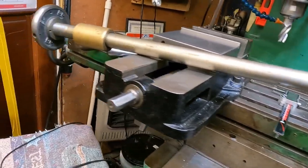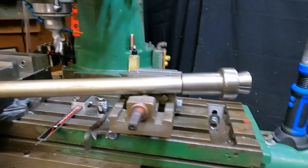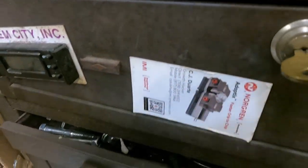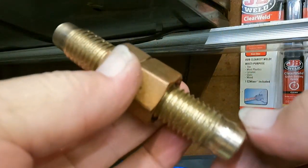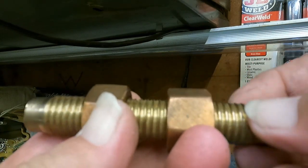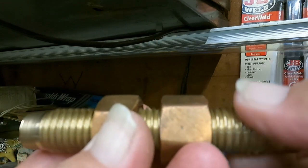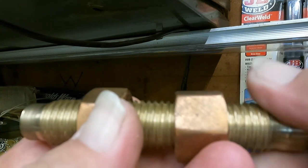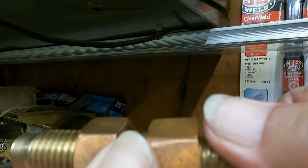And sometimes I look back and wonder if I could repeat half the stuff that I've done. Good example. Over here, I'm going to show you. I wonder. It is a both left hand and right hand screw. One nut's left handed, one's right handed. I did that in one setup. Could I repeat it again today? I'm not sure. I thought about trying it recently. Maybe I just need to watch my video and see how I did it.